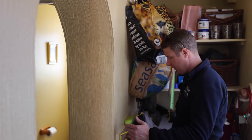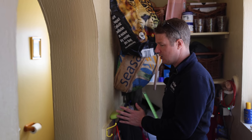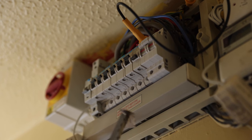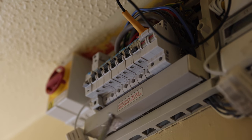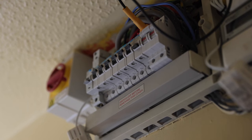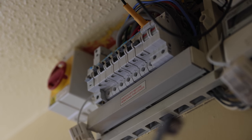In this case we're probably going to look at a SolaX battery — their 5.8kWh modules. We could fit three modules to bring us up to around 16–17kWh, which should cover most of their overnight usage. I'm measuring up now to make sure we've got enough space with adequate access for maintenance and ventilation. This looks like an ideal location. The existing consumer unit is quite old, has no RCD protection, and is completely full, so we'll probably need to upgrade it — fitting a new unit with surge protection device and RCBOs to protect all circuits to modern safety standards.